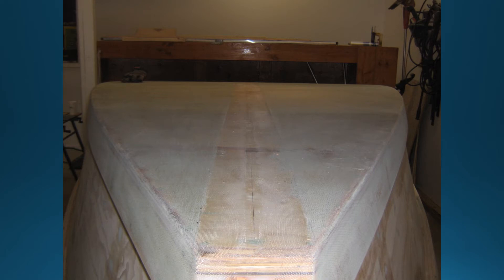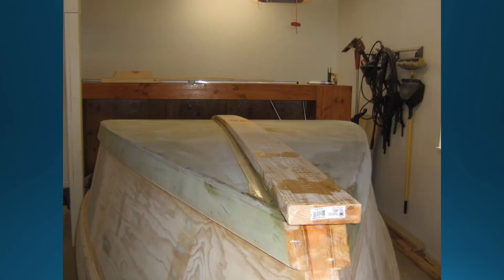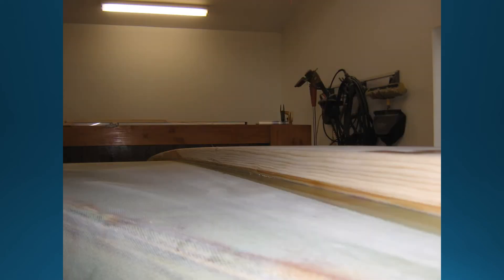Once everything had been dry screwed into position and looked good, I took it all apart and sanded the faying surfaces in preparation for epoxy. Here I am sanding the faying surface of the keel. Notice that select structural stamp — so far all the timber used in this boat has been select grade. Here is the keel after applying thickened epoxy and screwing it back into place. With the keel at eye level, notice how it curves over the horizon. There is a bit of bending stress here, which is why I chose a select board — one that already had a little bit of bow in it, somewhat matching this curvature.